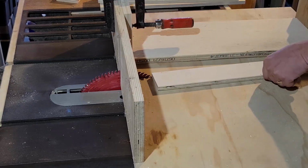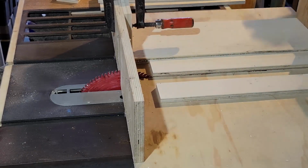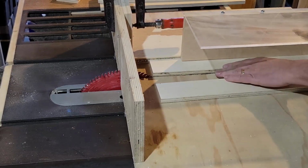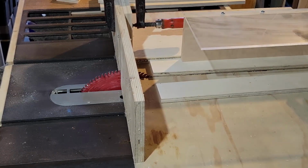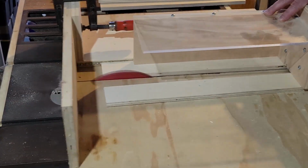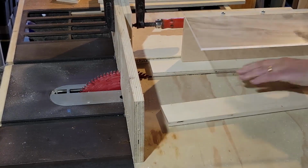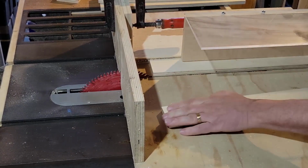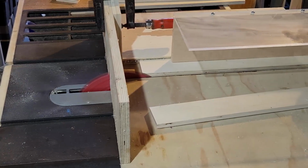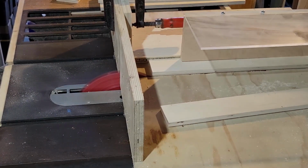So I'm going to cut these strips. I'm going to make them about 2.5 inches wide. It should give me enough play for, first off, screwing these into what is basically drywall. I'm going to use drywall screws and give me enough room on either side so that I can, like I said, play with the tension in this so that it would first off look reasonably nice and be firmly anchored to the ceiling, and of course hold that panel in place, and also allow it to be removed. So I'm just going to strip off 4 of these, and then I'm going to cut them at 45 just like we're making a picture frame, and then I'm going to do a dry run because, like I said, I'm not sure exactly how much tension this is going to need.